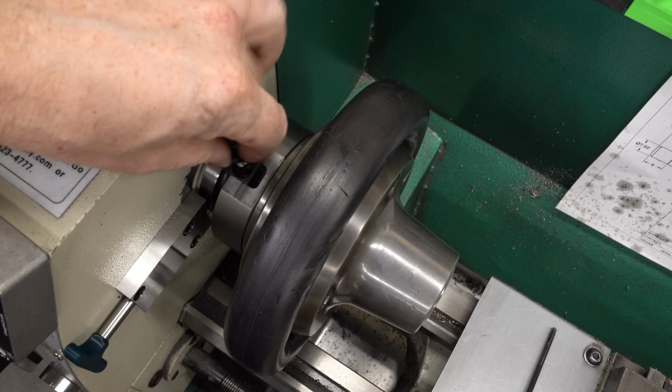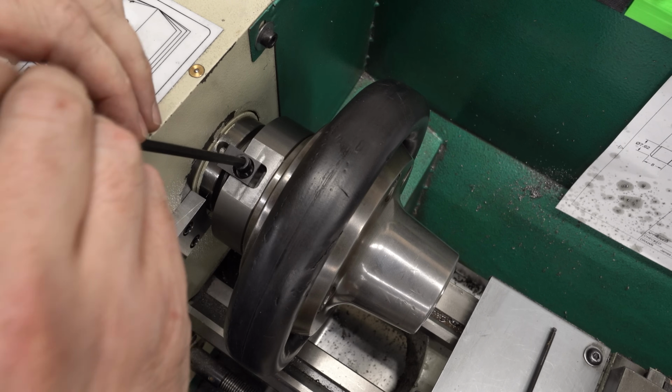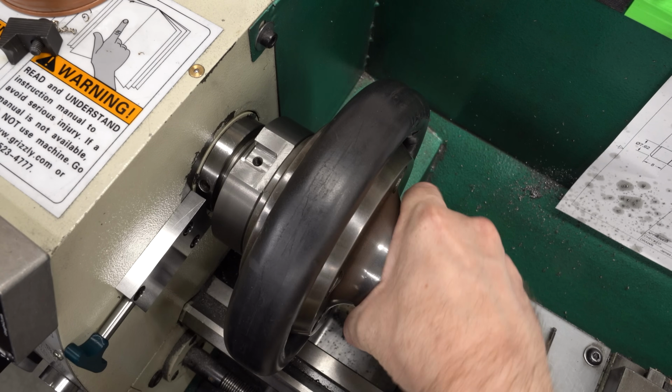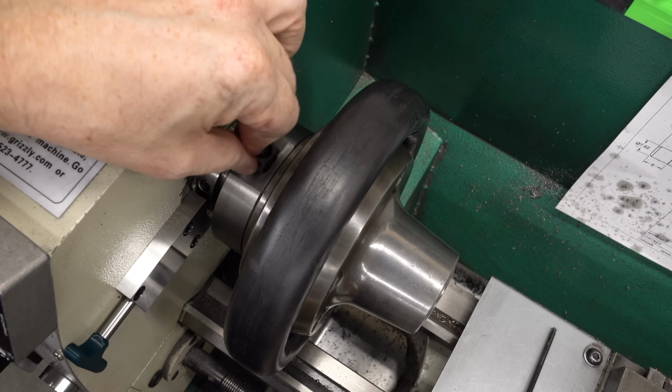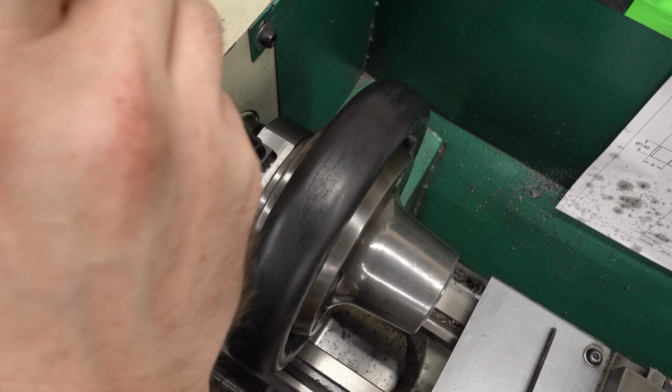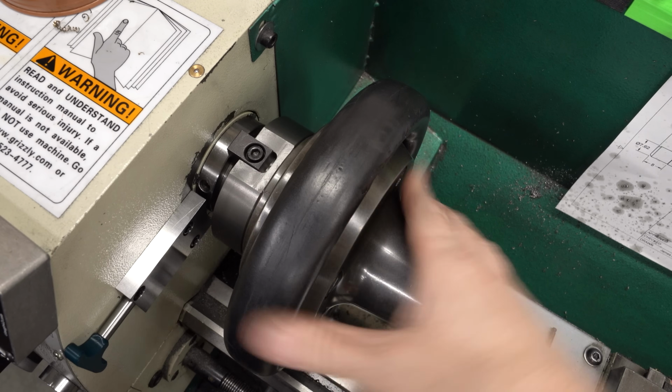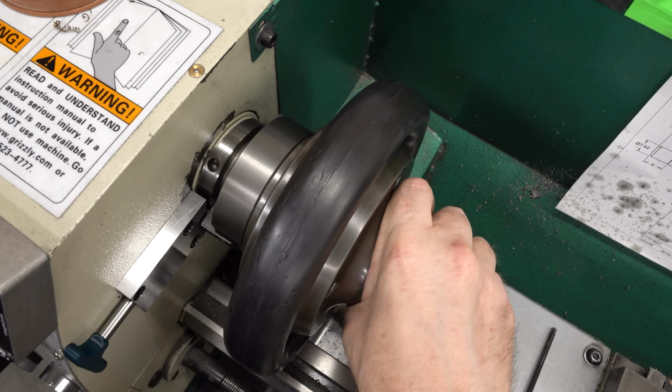This is a threaded spindle, so if you run it in reverse or if you slow it down suddenly, the chuck can actually spin off. People have had them spin off and end up on the floor in the middle of a job. That's bad news. Grizzly's solution for that is these little cam clamps that clamp it to the spindle nose so that it can't come off.